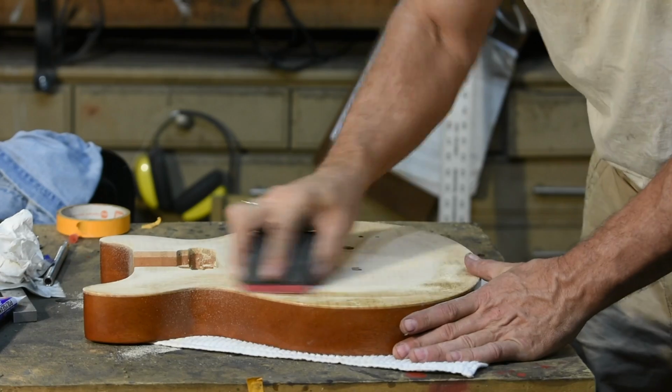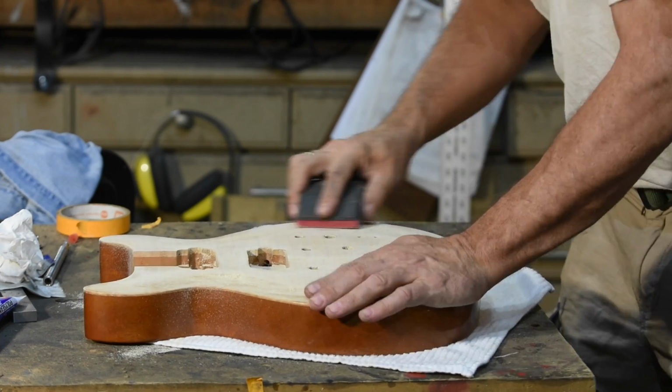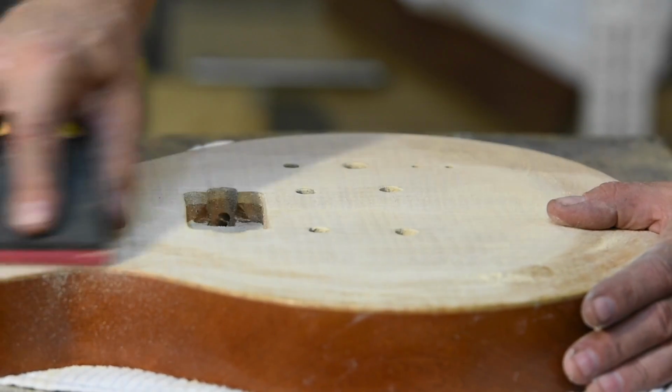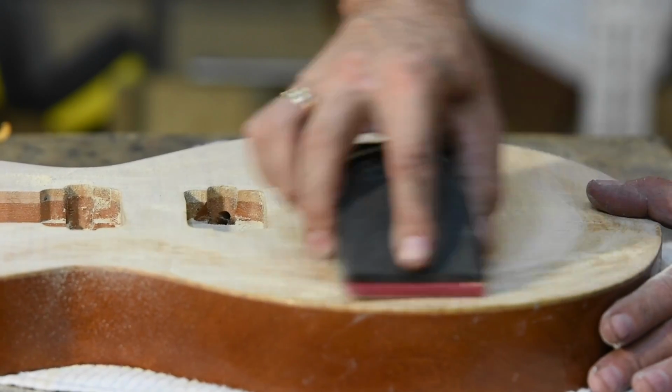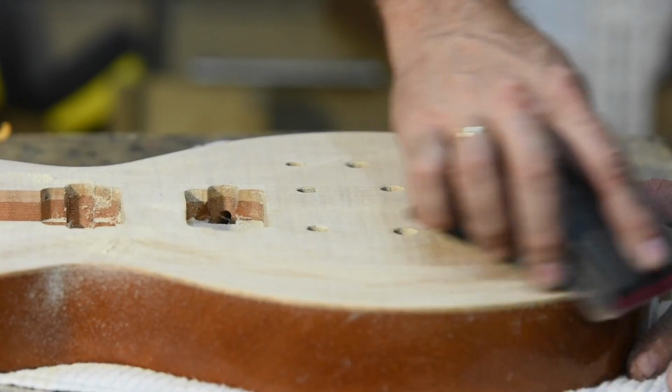Along the way, I'll also strip off all the lacquer. I did a crap job on the original lacquer, so this gives me an opportunity to redo. Last time I used brushed on marine lacquer or something really stupid and it came out pretty awful. So this time I'll be doing it more or less right using nitrocellulose lacquer.